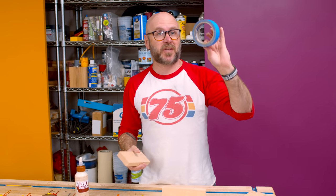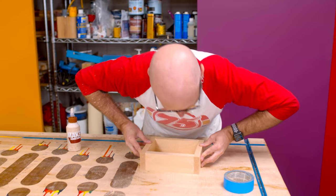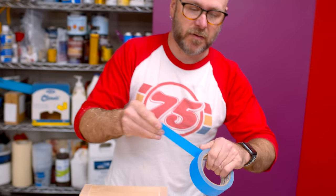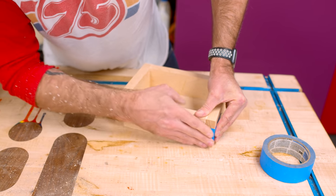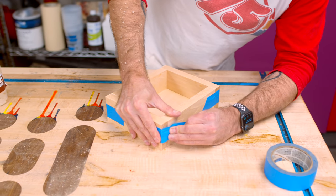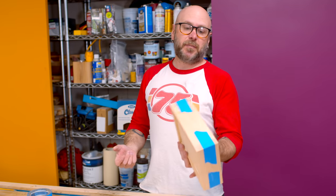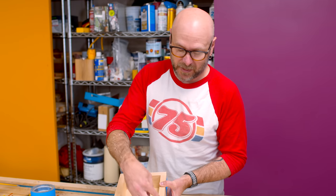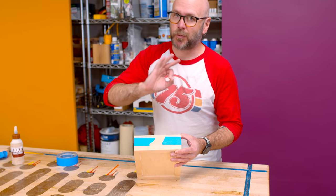Sometimes you run out of clamps, or don't have the right clamps. A lot of times painter's tape will work just as well — you won't get the same clamping pressure, but for small crafty items it works great. I'll get things lined up, pull it real tight so it tries to pull the pieces together, and that tape holds everything while the glue dries. These are butt joints, so they do need reinforcement — it's end grain and not a very strong joint. What I'd do is drill a couple of holes and put a dowel in there. Super strong, no clamps.